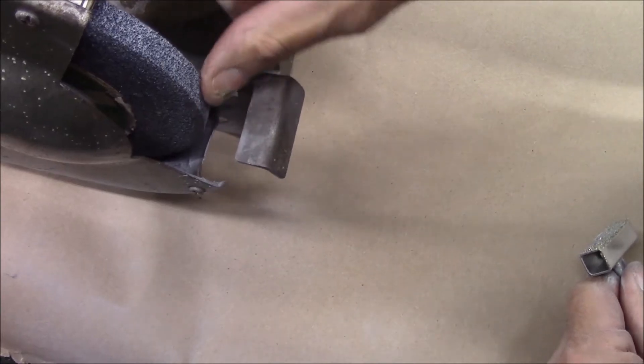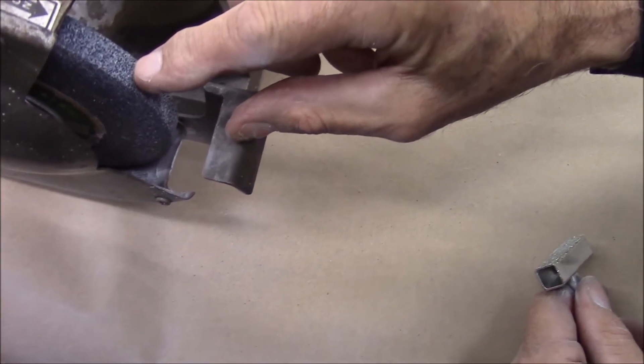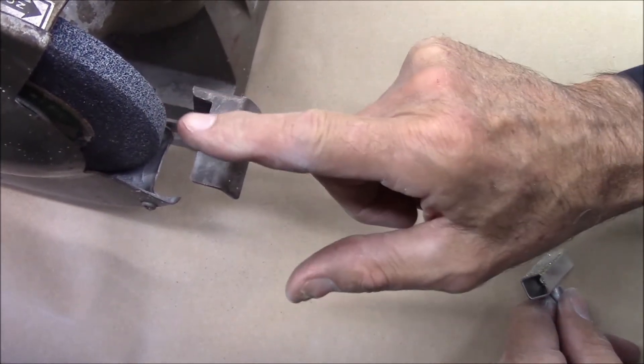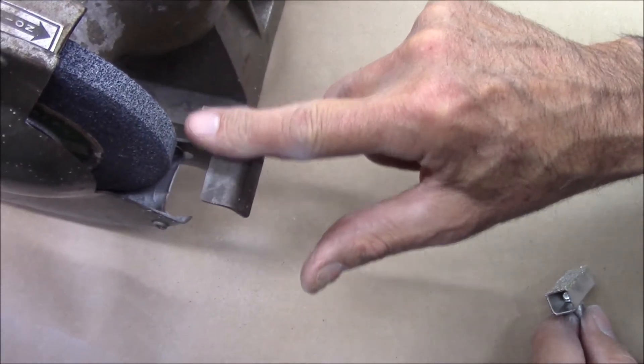This has been flattened and you can see it's a brighter color in the grinding wheel because we removed all the old iron and everything that was in the wheel. We're not quite done yet and I'll keep dressing it until finally this wheel is flat all the way across.